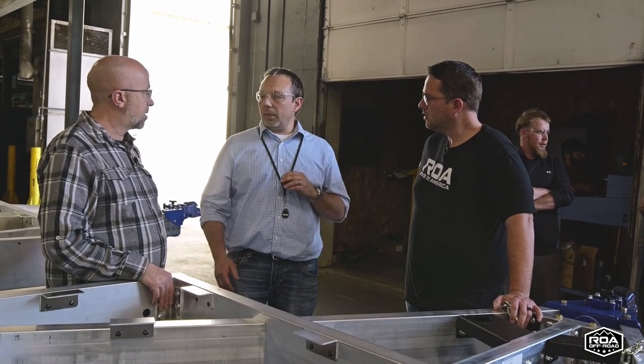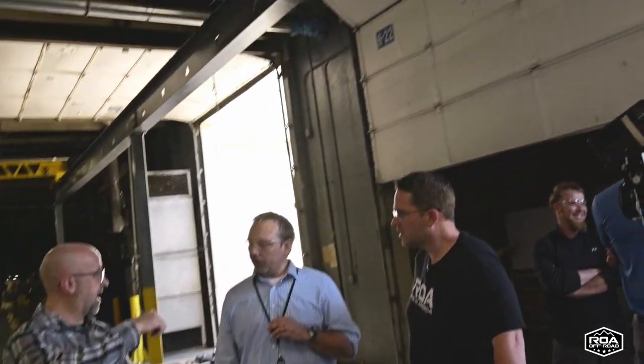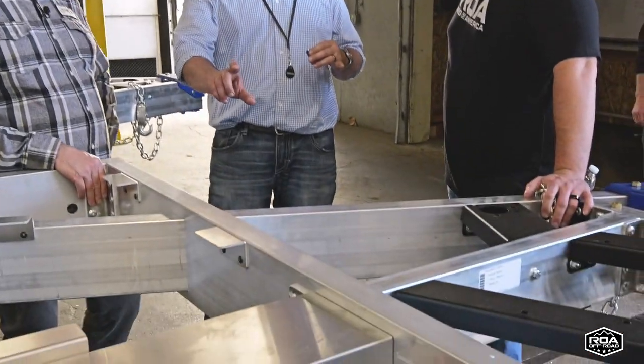But on the A-frame, didn't you do pressure testing too? Like, you put jacks on it and put a certain amount of pressure and kept going to see how much it could take? That came off of track data. We grabbed track data and looked at how many Gs we would get at certain locations. Then we took that data, rolled it into a test, and did a static test to see what kind of deflection we'd get. That actually resulted in a change to this A-frame. This A-frame initially was smaller, and we determined that was inappropriate because we were getting way too much deflection.